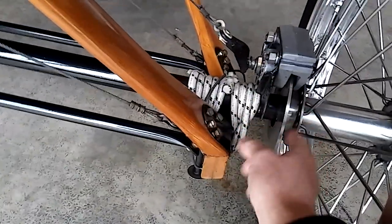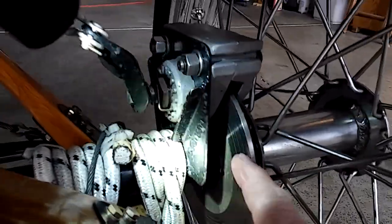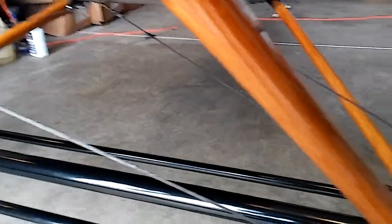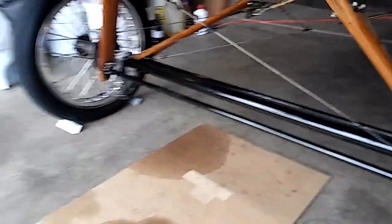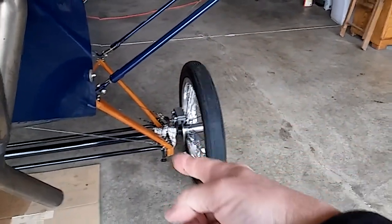I'll send you the video on how I did the brakes. I made my own wheels, and that's a stainless steel disc that a friend of mine machined for me. It's just a piece of 4130 bracket that I welded up to go to the landing gear — I'll send you a video on that. That's a whole other ball of wax, but you may have your brakes figured out. I just use heel brakes on mine. That keeps the axle from going back and forth and side to side, and also gives you vertical guidance. The axle won't rotate underneath the bungee cords when you apply your brakes.